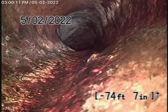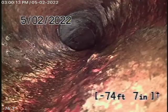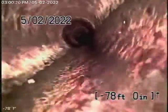This is where the pipe exits the house — it's going to change to cast iron pipe. Looking at the inside of the cast iron pipe, it actually doesn't look too bad. It must be getting old, but looking at the inside, it looks pretty round with a very minimal amount of rust buildup. It doesn't look too bad at all. Now, if the general inspector gets under the house and finds everything leaking, that's a different story, because we're looking at the inside of the pipe and cannot see the outside.